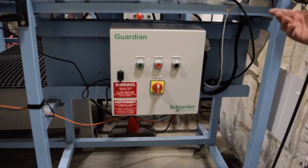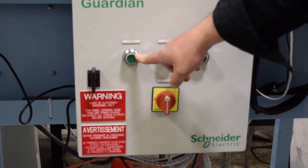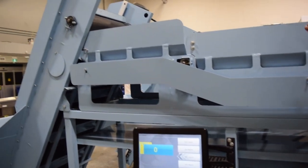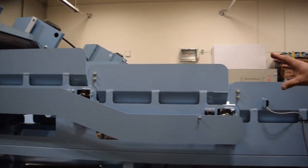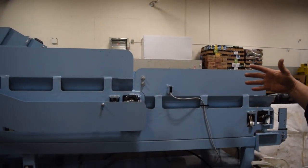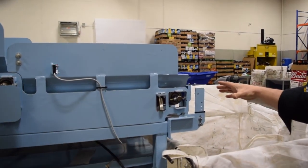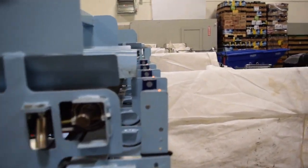Now I want to show you the heart of the system. When I press the start button, the cans will come up the incline conveyor and hit the three horizontal belts. This is where the cans and PET will get separated. At the final stage, they go through an ultrasonic sensor, which does the counting before the containers hit the mega bag.